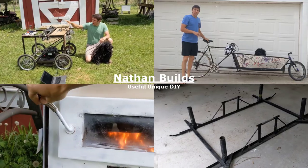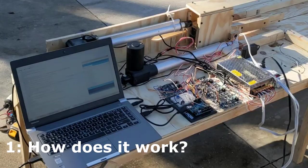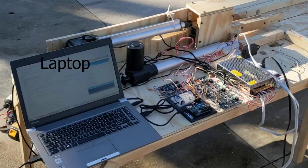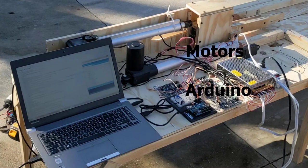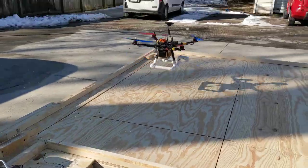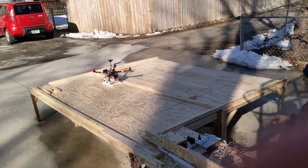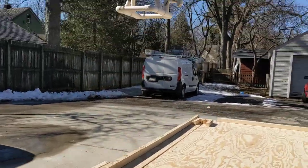This is my solution. It's just a Windows laptop that connects to the drone via a radio in the USB port, and it controls all the motors on the landing pad via an Arduino. This is entirely hands-off — you just hit start on a window presented by AutoIt, and the AutoIt script runs in a loop: first it sends the drone out on a mission, then collects the drone once it lands, swaps the battery, and sends it out on the next mission over and over.